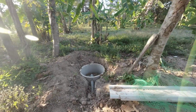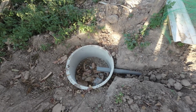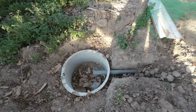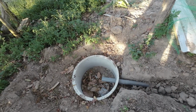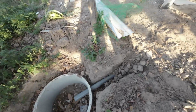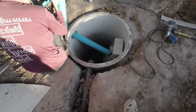So for the grey water overflow, it's only a small area anyway, so that's just got to be filled with stone. So I just got to trim that end off. Well, I don't really need to, but that'll be fine. Backfill this off, fill that up with stone, put some porous cloth down, and then cover it with dirt. Tomorrow they're going to be cementing the ends up there.